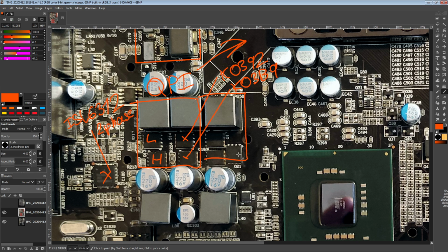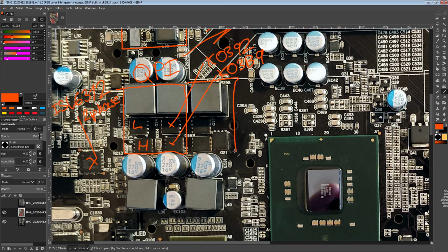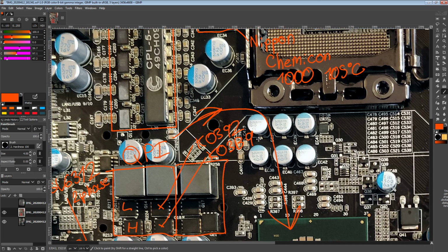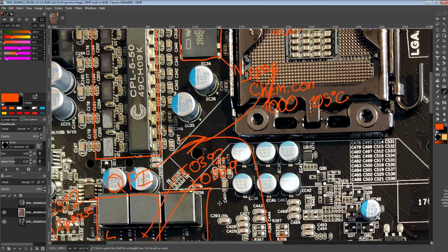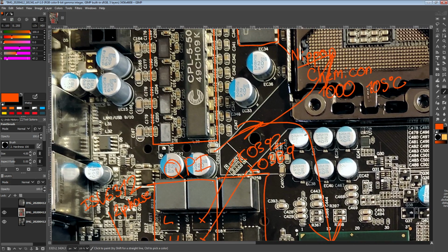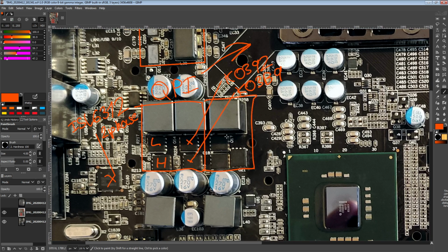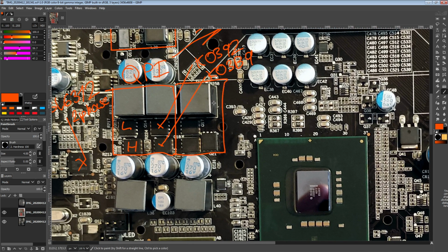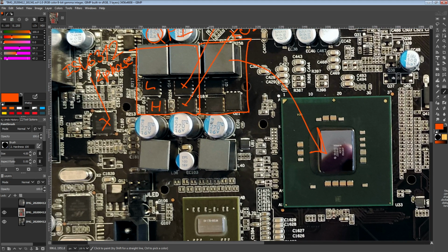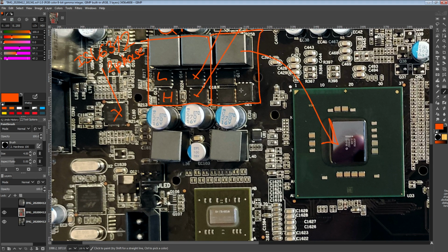Next to that, we've got the IOH VRM. So I assume the power from this actually goes both into there and into there, because that, as far as I can tell, just powers the entire QPI link. But the I/O hub, that's this one here, I think only powers the actual I/O hub itself and doesn't power the CPU at all. Might be wrong about that. Again, I don't know that much about X58. Hopefully, over time, I hope to get better at it.